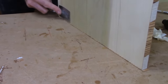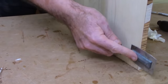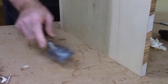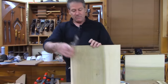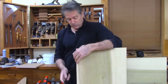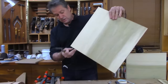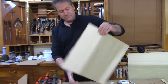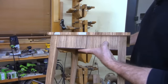Mike asks if it would be better for a novice to use more overhang to cut off. An eighth inch more than the thickness is really plenty, because the pieces of tape I wrap around keep the edging in position while you put the clamps on, so a sixteenth of an inch on each side is pretty generous. You shouldn't have trouble. And there you go — there's our top with the edging done. It looks pretty much like everything else, just up higher and wider.